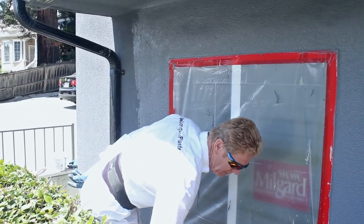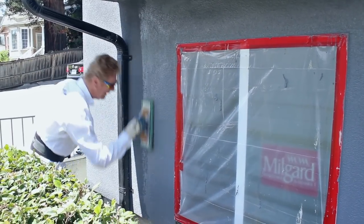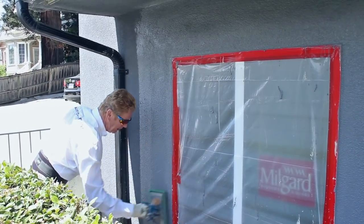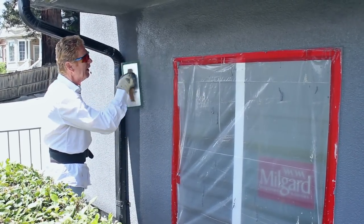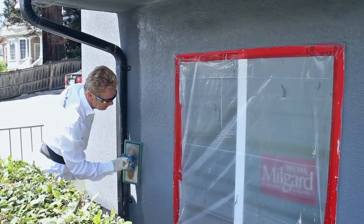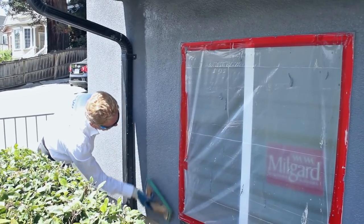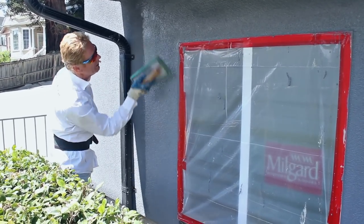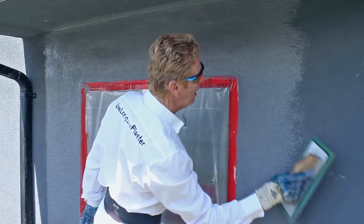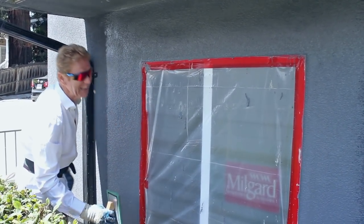That's what separates the professional repair guys from homeowners who don't know that little detail. On this last joint I'm cleaning the float again, wetting that transition a couple of times — as many times as necessary. Then I float into my own wet surface. Easy enough once you know what you're doing. Acrylics do take practice because they're gluey — like spreading glue — and they have a tendency to stick to everything: boots, hawk, trowels.